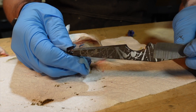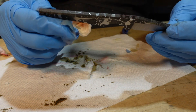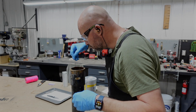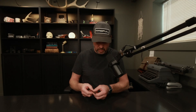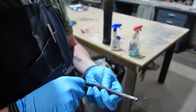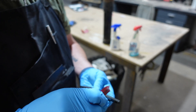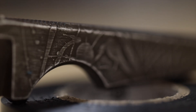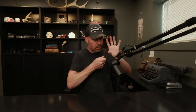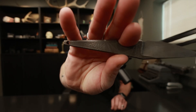After 10 minutes I wiped it off, and I definitely got a very distinct pattern in there. But more than that, I actually got a texture — and that's what I'm excited about. I didn't really love the look of the shiny steel versus the darkened steel, so I decided to wipe it all down and gave the entire thing an acid etch. Once that was done, I pulled it out, cleaned everything off, and then very lightly went over it with some sandpaper to knock off the etchant from the high spots. The cool thing is you can actually feel the texture — there's actual texturing on there.